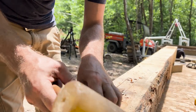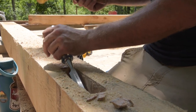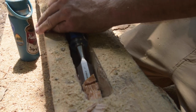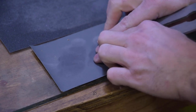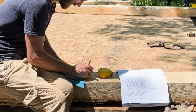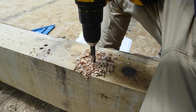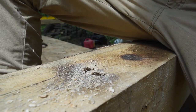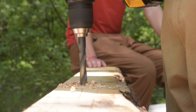I decided I'm gonna use the same chisels because they're the only ones I have. The thing is they're not very long — I've got an eight-inch piece of white oak to get through and this chisel is maybe a little over three inches tall, so once I'm maxed out it's going to dig the handle into the side and push into the wood, which is not ideal. On top of that I have not mastered the art of sharpening chisels yet. We marked off our mortise and tenon, started with the oak, made our mortise mark, and decided to just start chiseling — why not, it's gonna be fun.